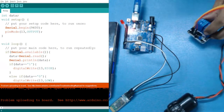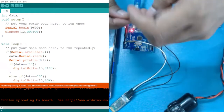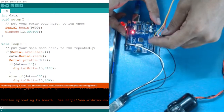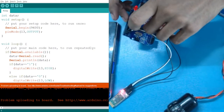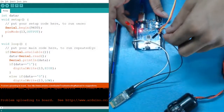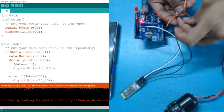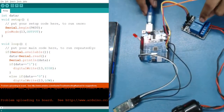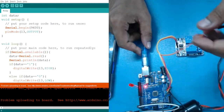You can see 3 pins. Now let's connect. The first one will be your VCC, connected with the main. After that we have a ground. We have an extra ground, so I can connect them easily. After that we are left with a single pin, that is your INT2, or this relay output pin. So we have connected VCC, ground, and this is our output.